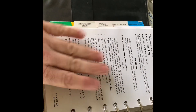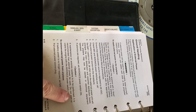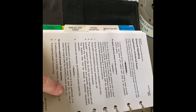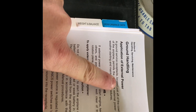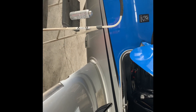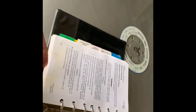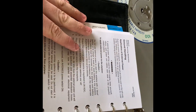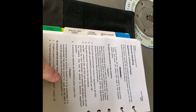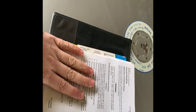Here's the lesson this pilot learned: do not start or crank the engine with avionics power on if you've got external power connected. Another shop told him he needed a four-thousand-dollar MCU. We told him he needed a one-dollar fuse, plus two hours of labor for troubleshooting and installation. Read your POH - it'll tell you what you need to know. Don't start with external power and your avionics on, because it's going to pop that 30-amp fuse.